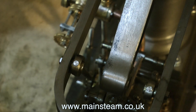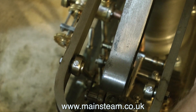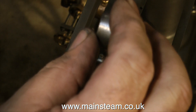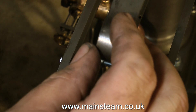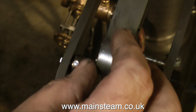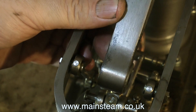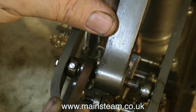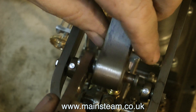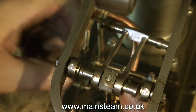But I could just do with a tiny bit more to move the beam slightly over. I don't intend to move the position of the centre shaft again. It's looking like there's just enough slack in the centre bearings to move the beam across a fraction more — and I do mean a fraction. It's an optical illusion really, because the builder has removed some material from the left-hand side of the beam but not from the right. So if I was to remove the material from the right-hand side, it's more or less in the centre. When I temporarily fit one of the original pins, I can see how much better the main beam is — it's lining up with the centre of the piston rod, which is what I wanted.